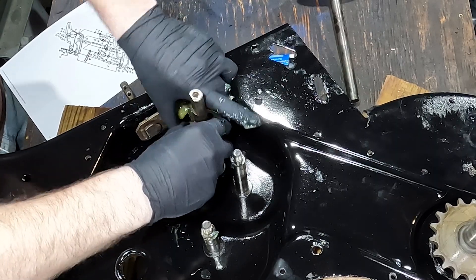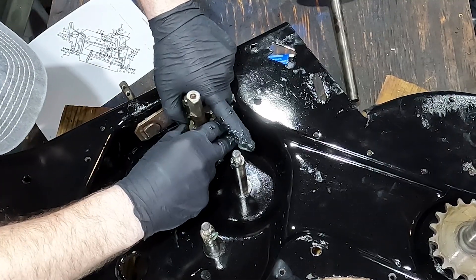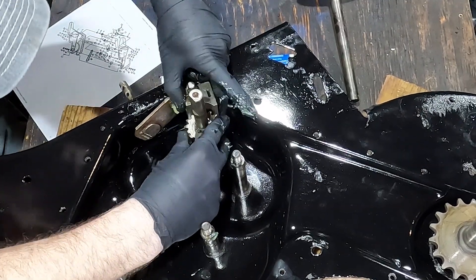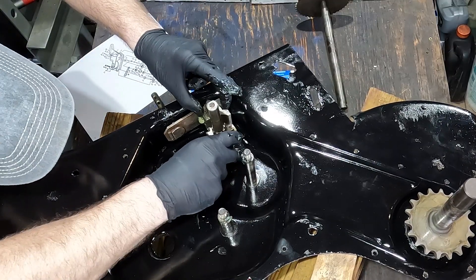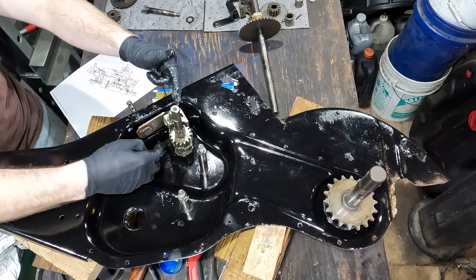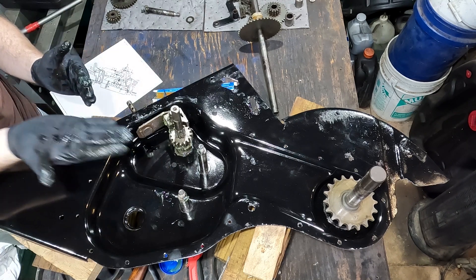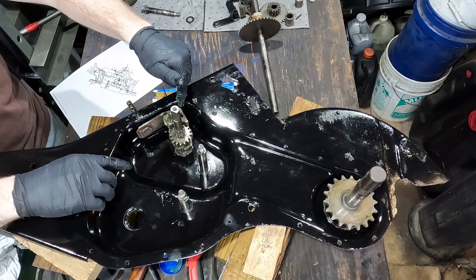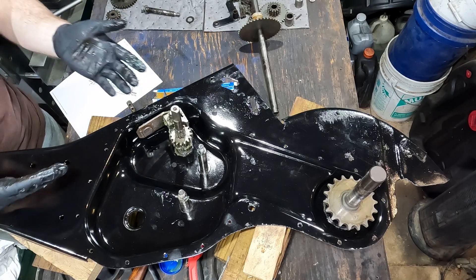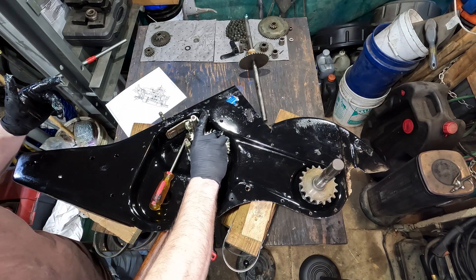I'm going to assume it goes down and gets caught behind this rib here — like that, and then like that. That's the shifter. So up here is the shifter, and you move that up and down, which moves the gear up and down, selecting which gear you have. There's a cutout, like a little hand, on this block, and it fits right into that, so it moves the gear up and down. Otherwise it would move it one way but couldn't pull it back, so it has to fit into that groove. I'll put that little thin one on there and then slide this on.